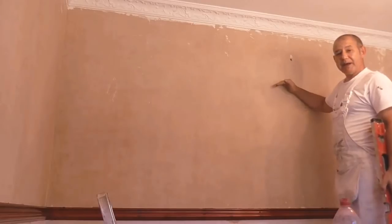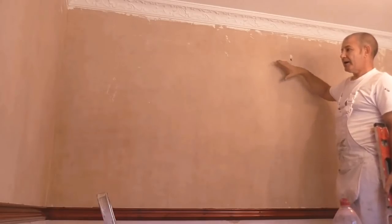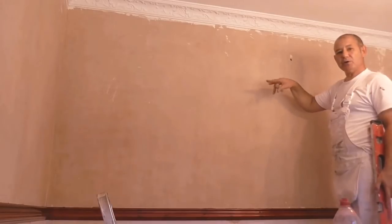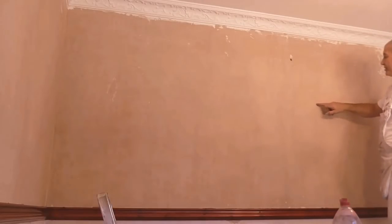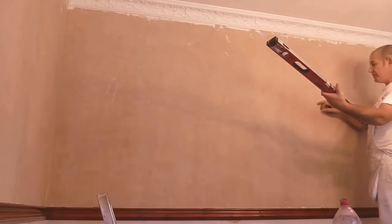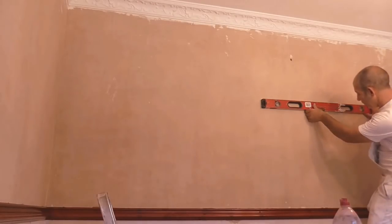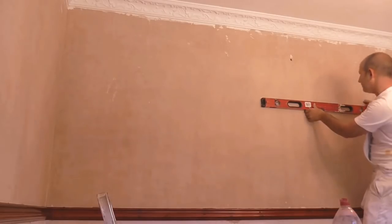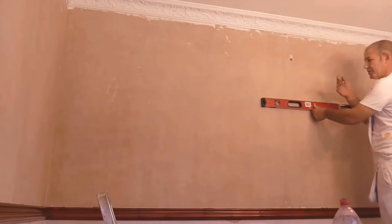For cross-lining for painting where you probably want your joints to be more in line, or if you're hanging a striped paper horizontally, this method is perfect. But then always only take one measurement — so for instance I've got 20 inches down from the coving and I don't need to do any more. I've got my spirit level; as long as I offer that up to the line exactly on that line, I line up the bubble and that's it. I just need to run my pencil through to mark my line.